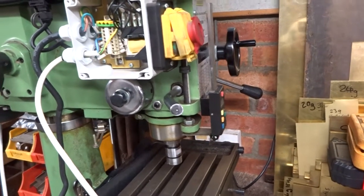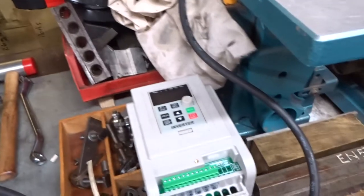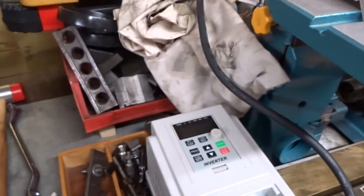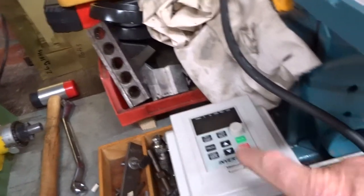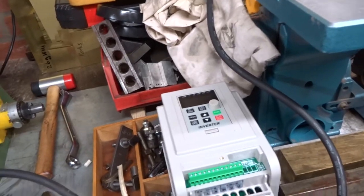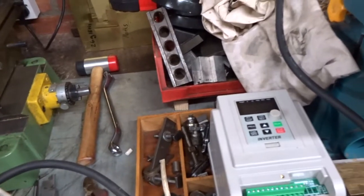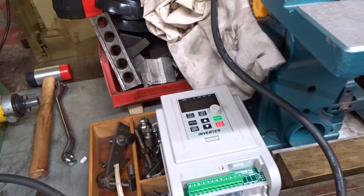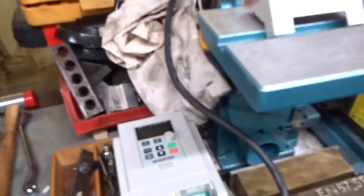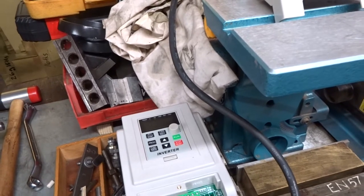Not entirely. So now, it's off. Interesting. When this thing was wired directly into the main supply, perhaps I didn't have it running long enough, but the red writing didn't disappear immediately, implying that residual voltage was being stored in the device, and don't put your finger in it. Curiously, using that contactor, the writing went off immediately. So that's good, isn't it? Or is it?